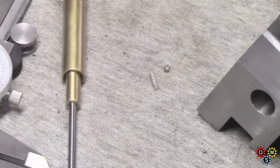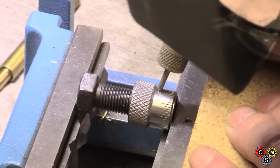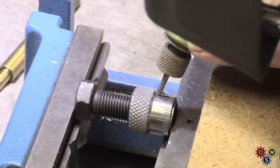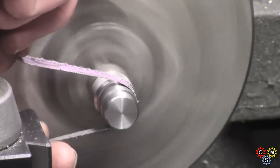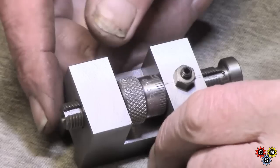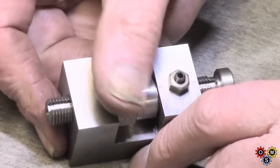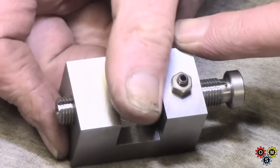Here's a closer look — tiny ball, tiny spring. My number stamps are way too large to be practical on this, so I'm using a small hand engraver. It's a bit rough and ready, but it's about the only way I could get the numbers on. Quick polish on the rather crude engraved figures, but it smooths them off quite nicely. Now we'll try out the function of the vernier, see if it turns all right and moves the rod, which tracks nicely. The detent ball gives just enough tension so that when you leave it in one position, it stays put. That works quite well.